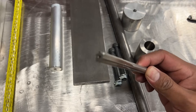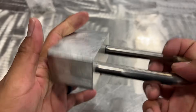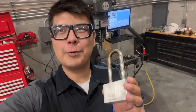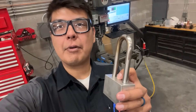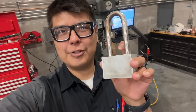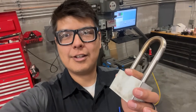The original reamer I had didn't really work, so I ordered a larger one that was one thou bigger, but the fit was too loose. I tried a 0.415 reamer and it cut a little too big, so I got a 0.4145 reamer — half a thou smaller. I'm going to drill some practice holes in this lock body, since I can't add material back once it's been cut. If it works, I'll cut out a new lock body and ream those holes out too.